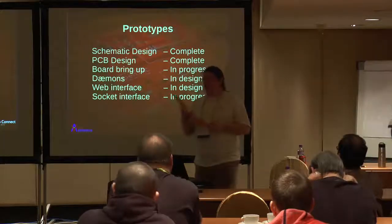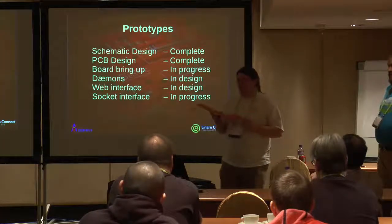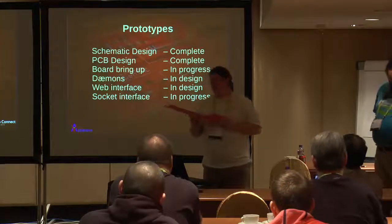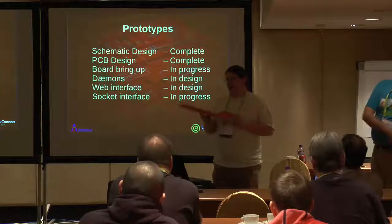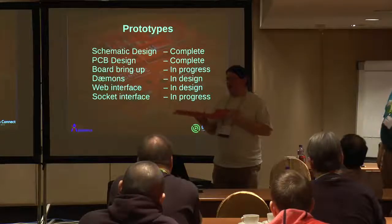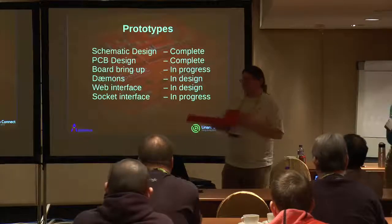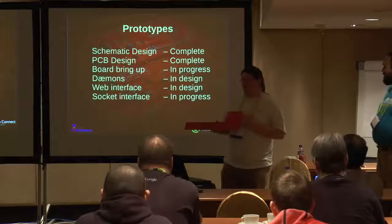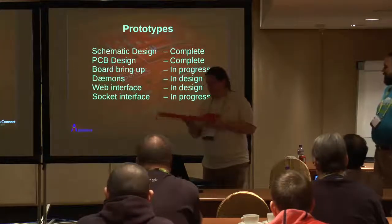Actually, 0402s by hand is not a problem. 0.5mm pitch ICs genuinely aren't a problem. The USB hubs and the USB to serial are on 0.5mm pitch QFNs with a ground plane. So I had to borrow some specialist kit for that. But we've got the chips down now.